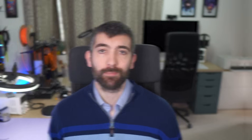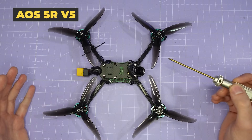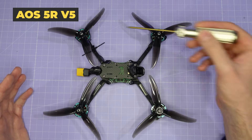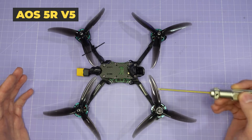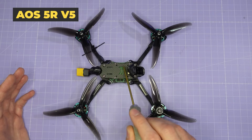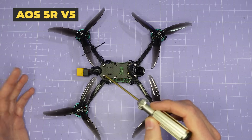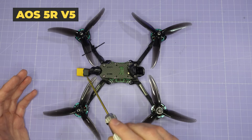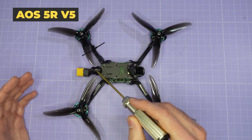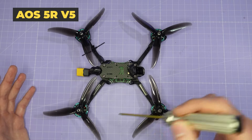That's the rundown of the AOS 5 V5. If you're interested in the full specs there are links to AOSRC.com down in the video description. Now let's take a look at the AOS 5R. This is the 5 inch racing frame in the V5 series. Geometry wise we have a true X geometry again with support for up to 5.3 inch props. On the top plate we have 25 by 25 and 20 by 20 M2 mounting for a VTX and also some slots cut for mounting a receiver. All the 3D prints you see here — the shark fin, the antenna and receiver mount, and the arm guards — are all available on AOSRC.com.